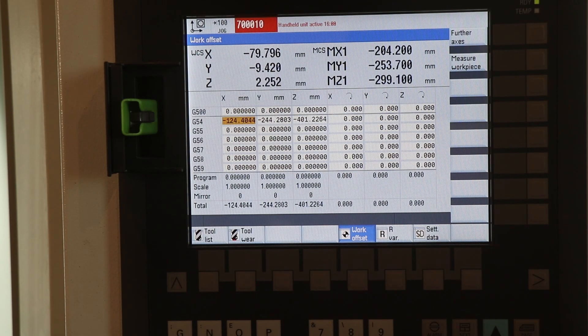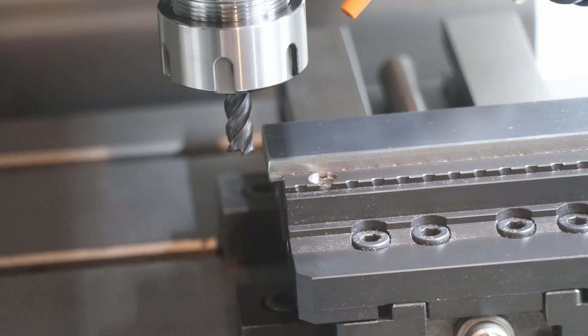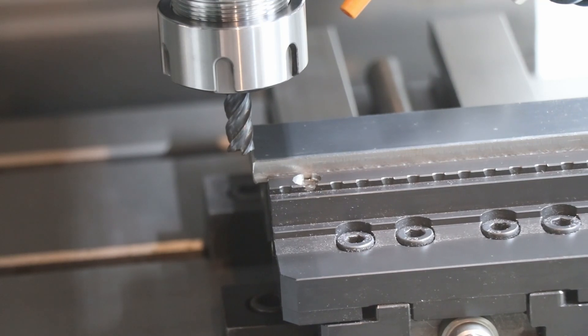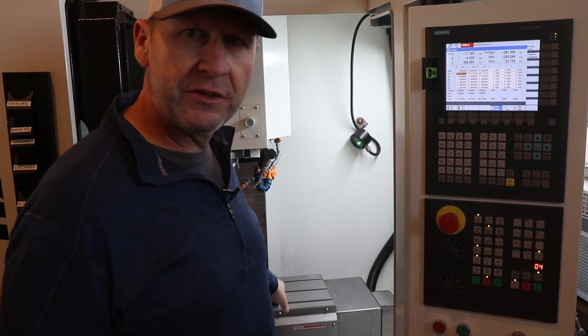This is very similar to setting up work offsets manually on a CNC lathe — on the lathe I would go into MDI, or here MDA, and do a zero maneuver automatically. But this is easy enough. I'm switching down to micron mode... and zero. Let's look in the machine and see how that turned out. That looks pretty good. I knew it would because I knew I made the mistake in my CAM — yeah, right at zero. So now that we've determined that the length offset is correct according to the top of the surface we've probed, I'm going to run the program again.